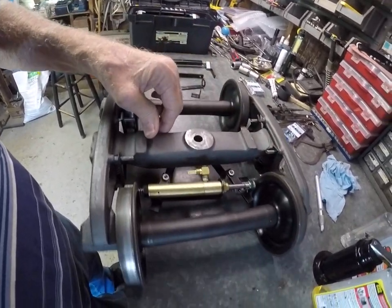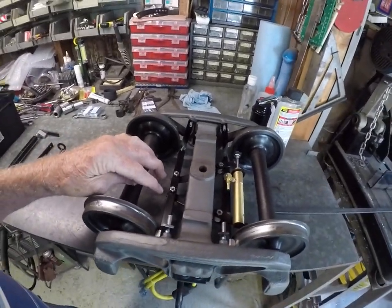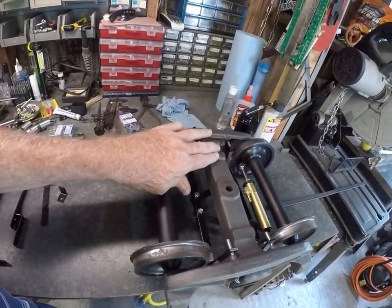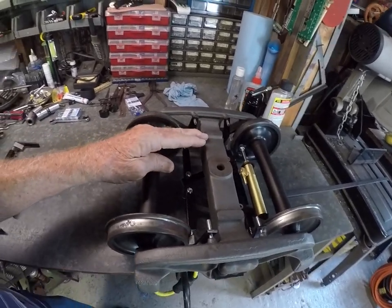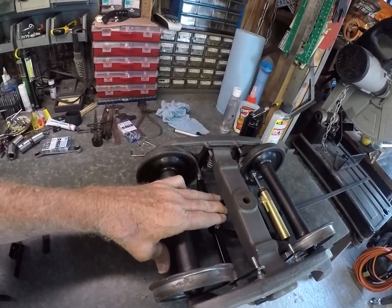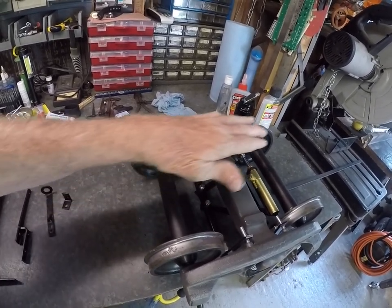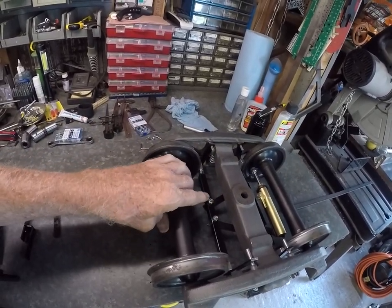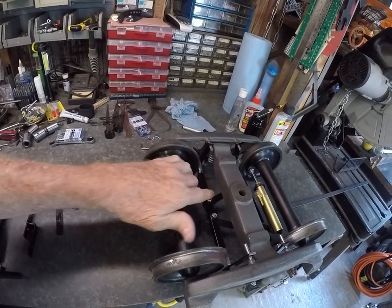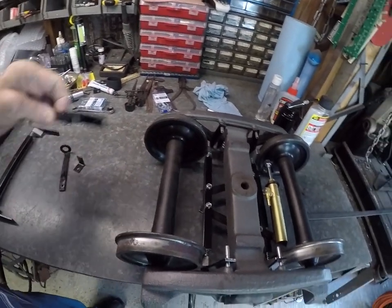The main problem with the Tom B's truck is that the center portion is lower than the Mountain Car's, so that puts the bolster lower. Therefore, when you compress the springs with the weight, it's going to touch the top bar if you put a bar across the top.